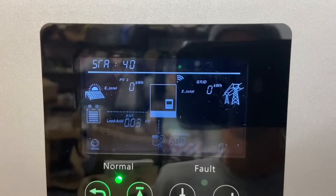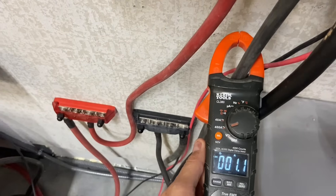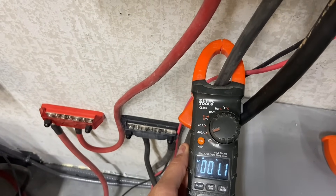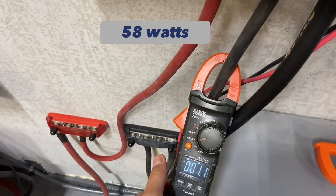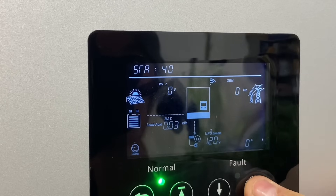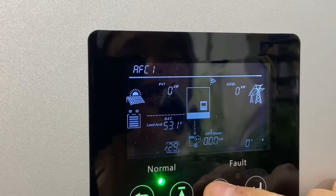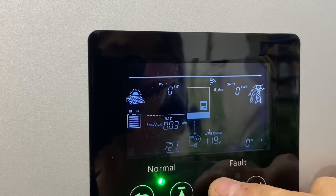Idle consumption is something I wanted to cover. Right now we're at 53 volts times 1.1 amps, so that puts us somewhere around 54 watts. If we go to menu and go to option 20, there's a power saving mode on that.